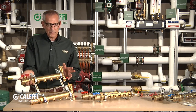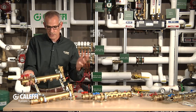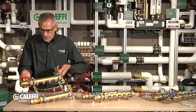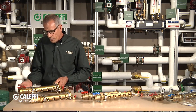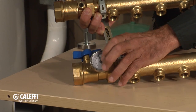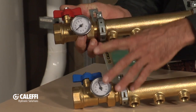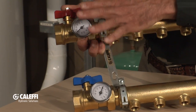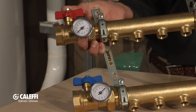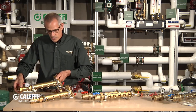So this is our high flow manifold. It can be used for a lot of different things — it's not just a radiant manifold. There are chilled water systems and chilled beam systems coming on the market too. It's a distribution manifold that can be used for hot or cold water. High flow is the key. We also offer optional temperature gauges — we give you wells right in the isolation valves that you just slide them into. That gives you the ability to read the delta T across the manifold. If you know the supply temperature and the return temperature, you can calculate how much energy is being put into the system by knowing the delta T and the flow rate.